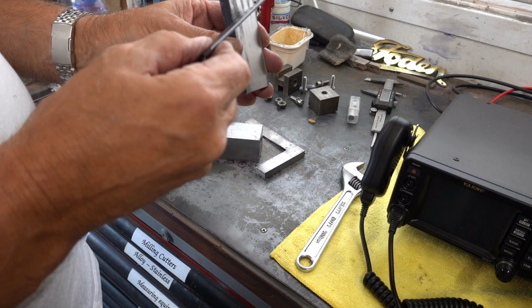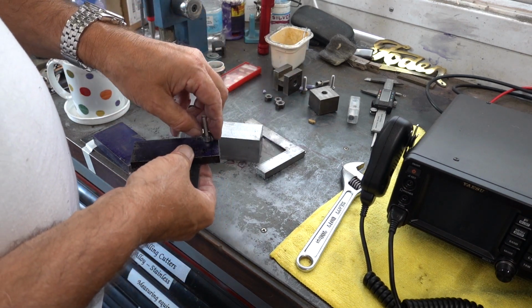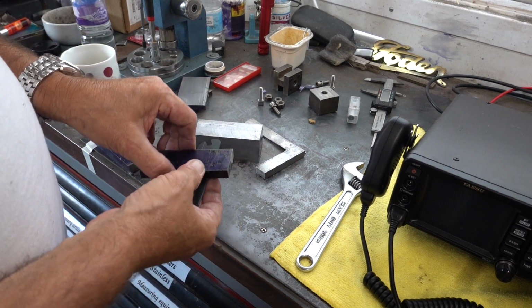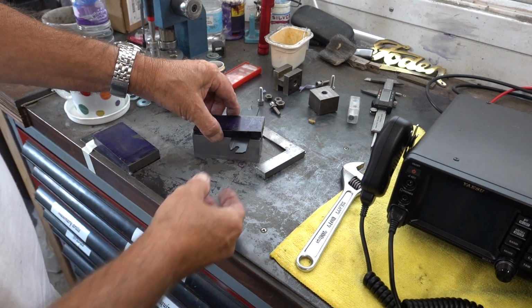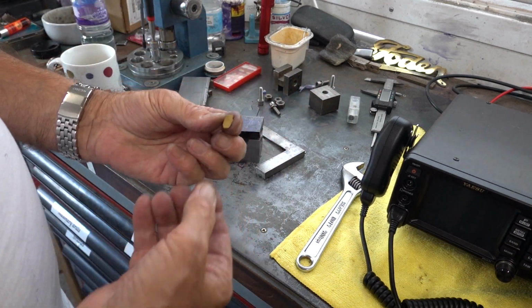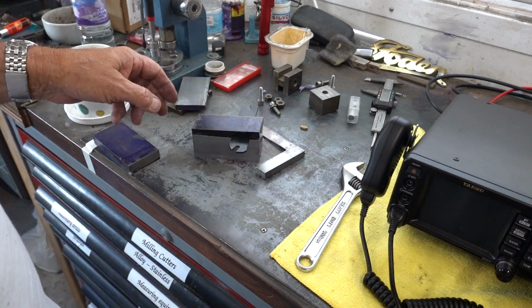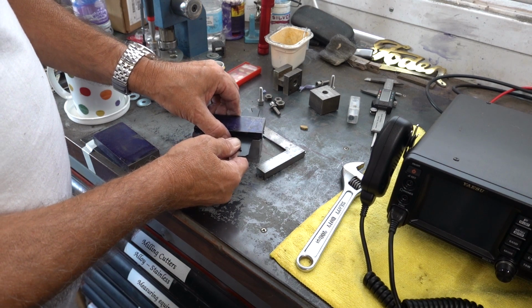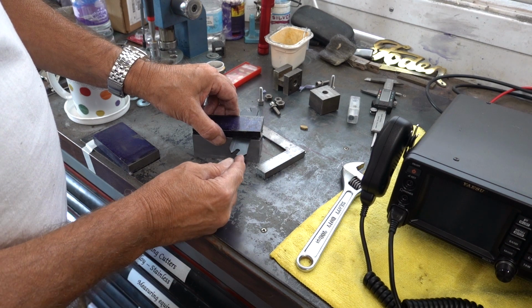This is going to have this machined out to accept this, so that I can put 4 bolts in it, and 2 here, 2 there, and 2 below, and they'll be counterbored and slotted, so that I can move this up and down. So obviously dead centre would be dead centre of the tip of that blade to the centre of my chuck for parting, but with a little adjustment up and down, just because sometimes these are not always exactly that size, and if I got some others and they weren't the same, then this wouldn't be on centre line anymore, and there'd be no way of adjusting it. So that was my idea of having an adjustable parting off tool, that I could move up and down, only by a small amount, probably maybe 3mm total, 4, that's all, just so I've got a little bit of either side of centre up and down.